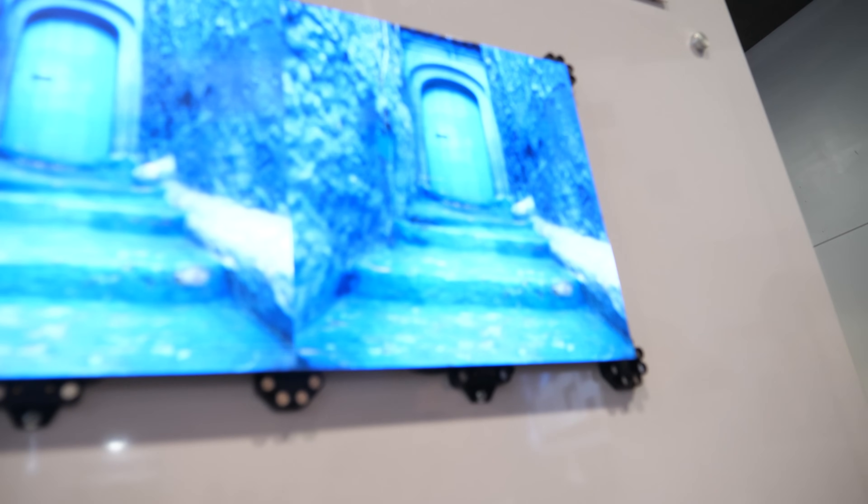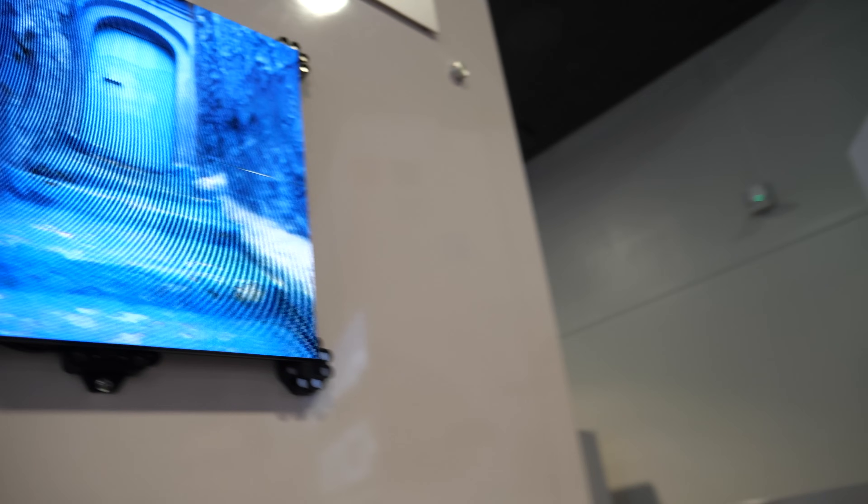There's a large SOC in the main processor handling all the 8K and all of the distribution. Baseband input comes in via HDMI, and we output fiber optic to the tile array. Every tile actually has a very small processor built into it, so every time you add a tile, you're also adding a video processor. The larger your wall, the larger your processing array, and everything works in harmony and stays in sync.